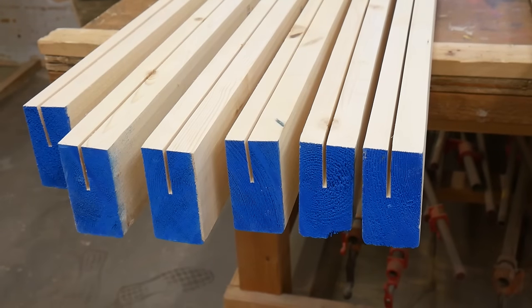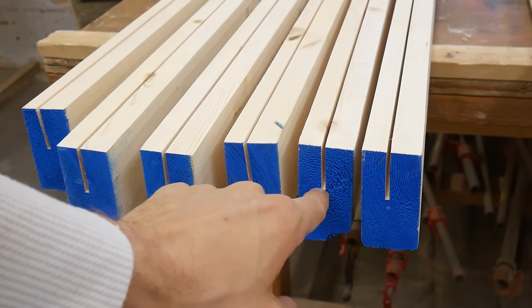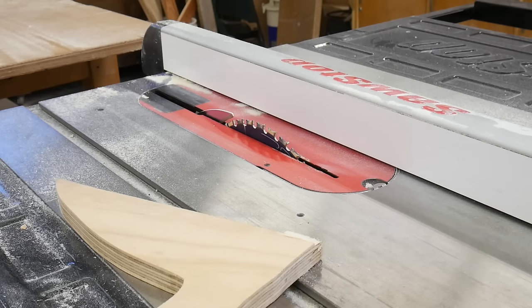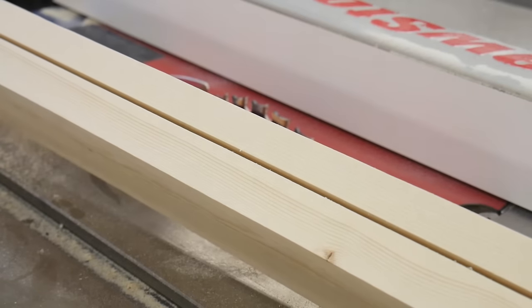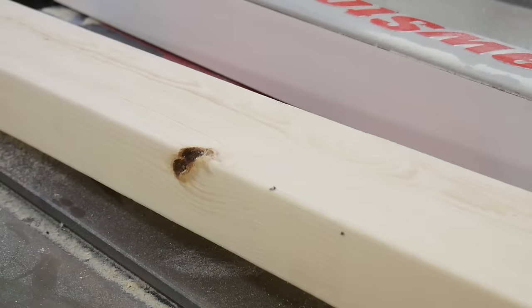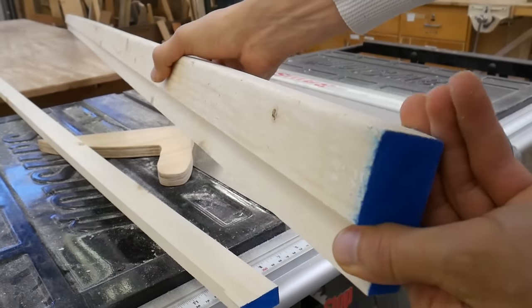Now you should have four boards that look approximately like this. We have a slightly offset cut here, and now we're going to come in and just meet that incision and get rid of this chunk right here. To accomplish that, we're going to do the inverse of what we did before — instead of a one and a half inch high blade and a three-quarter inch gap, we're going to do a three-quarter inch high blade and a one and a half inch gap. It's key to make sure you're coming in the right way — we want to chop off the shorter section. Now you can see we got that nice bit of wood taken out there, and we're ready for the next step.